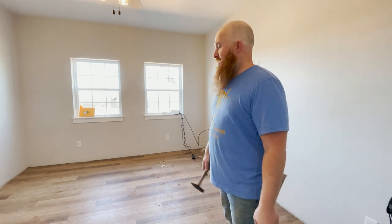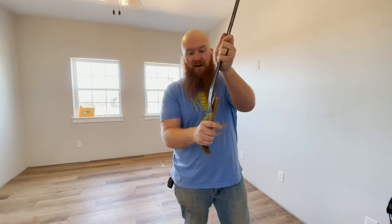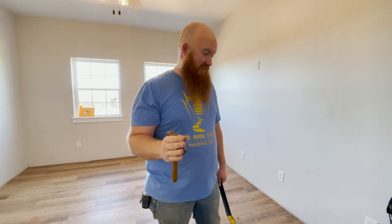It's not going to do much, but it gets it out of the way and you're not having to deal with the sheetrock. The most important thing — always remember you are about to cover up everything that you're removing. In this instance I'm taking out one-by-six boards and putting one-by-six boards back down. If I was to pry above the baseboard, anything above it is subject to damage from the pry bar. But if I stick the pry bar in down low and pry off, the fulcrum is now down here.